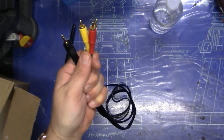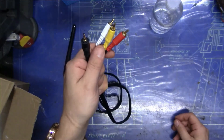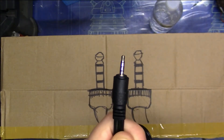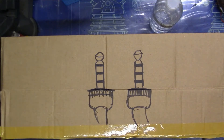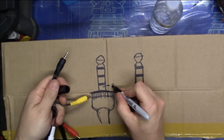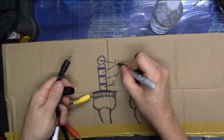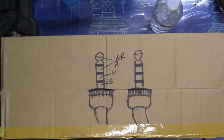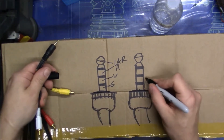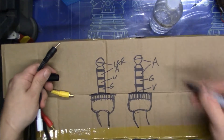This is the composite video cable that I ordered online for my RetroPie, but it's not right. Now you can see that this plug has several connection points, which I've illustrated here just to make it a lot easier for you to see. The way that this plug is wired up, this band is the ground, this band is the video, and then these two bands are the left and right audio. The problem is that the RetroPie that I'm using needs a plug that is oriented with the ground here, and the video here, and then the two audio channels are still there.